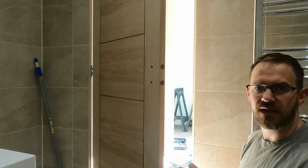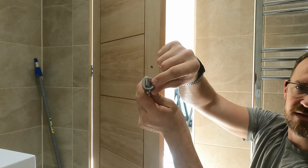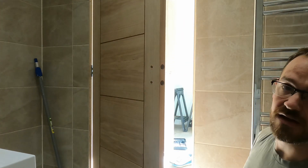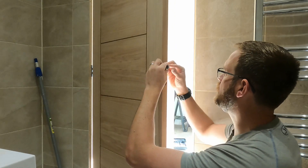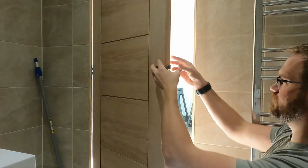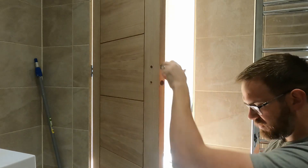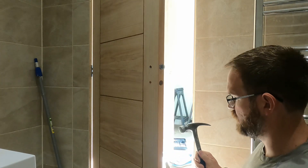On these you've got a closing edge on them. This bit here is the closing edge - that's the bit that comes on the inside edge of the door. The beauty of these is you literally just line them up and push them in. That is it. That's all you need to do to these latches - you don't need to do anything else. It's just a push fit.